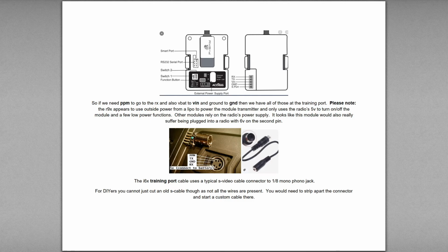And you need a more advanced radio that has the functionality built into it with all the UART conversions and everything, so that you can just plug them in with a cable to your radio, plug the receiver into your module bay and flash it, or plug your module into your module bay and flash it, or flash the radio itself without having to have anything more than a normal USB cord. You don't need that extra UART converter in there. But this radio is simple enough that it doesn't have that inside of it.